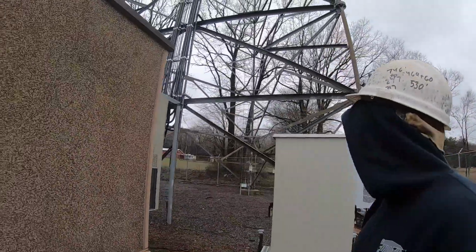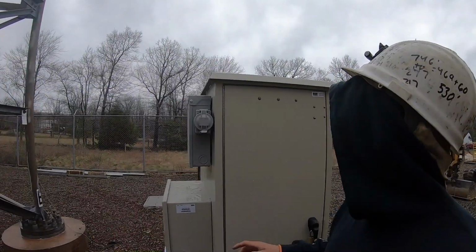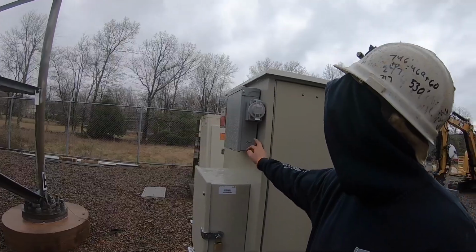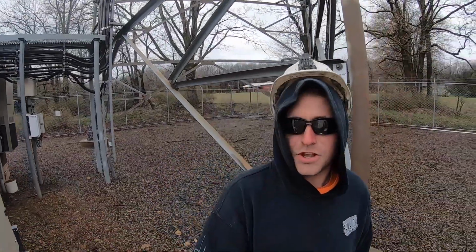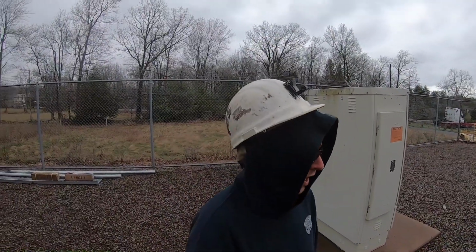And put a 90 again. And then we're gonna switch over to 1 1/4 inch pipe to get up inside of our box here. We're gonna start by stripping out the stone. We're still waiting on the PM, or project manager, to get back to us to see if this is in the right spot. According to the drawings, it's not. So we're gonna get a double check on that.